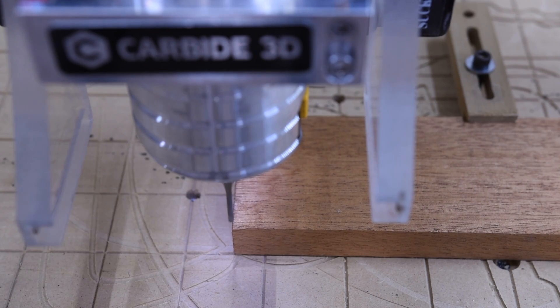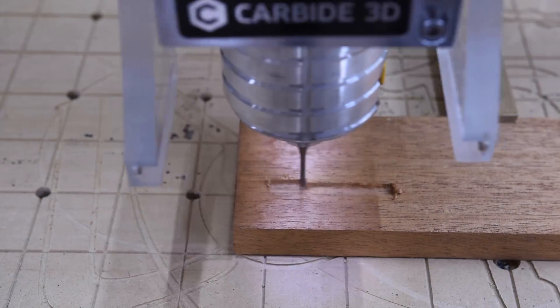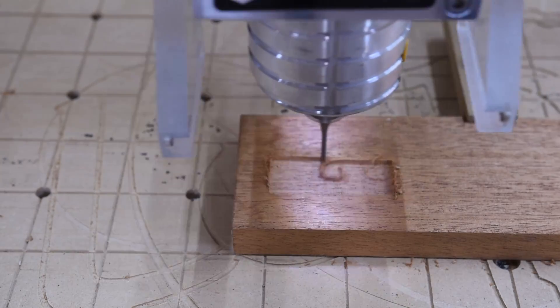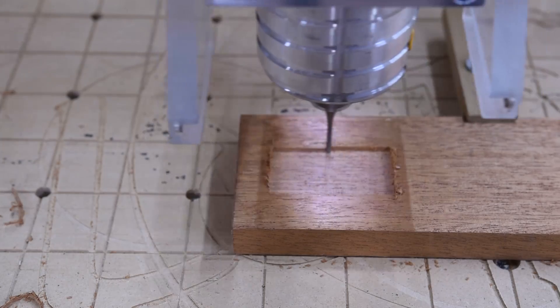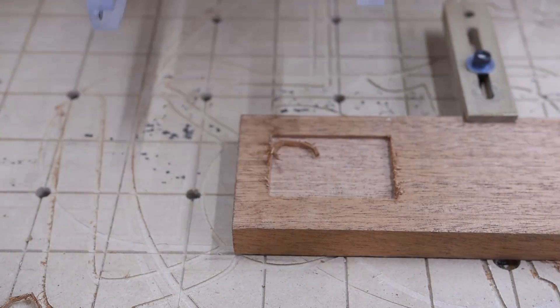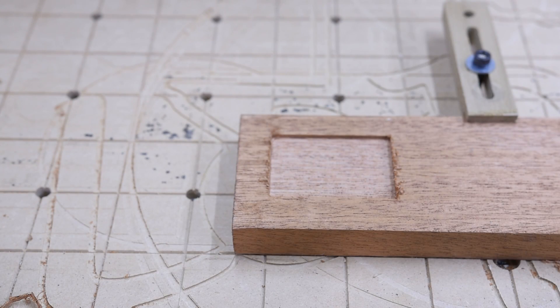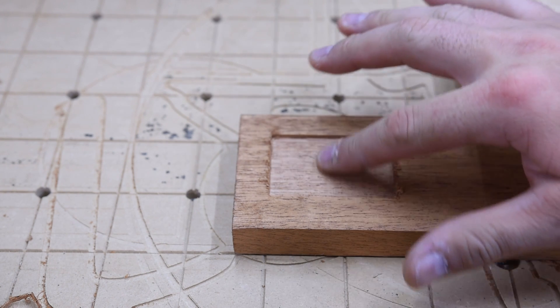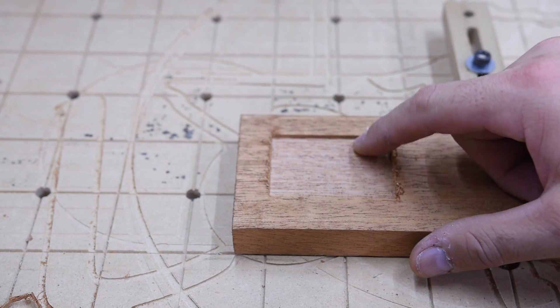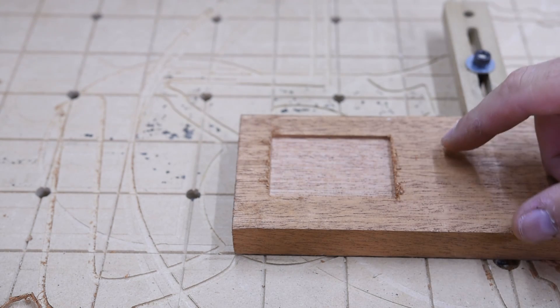Start. Okay guys, I think I just answered that question. Once the probing is done, you do not have to zero anything — you just go ahead and load your file and let it rip. But I do notice that I'm having some tramming problems. It's hard to see in mahogany, but I can definitely feel it. That's something for me to work out at a later date. Let's move on to only doing the Z axis.